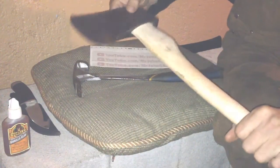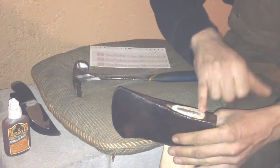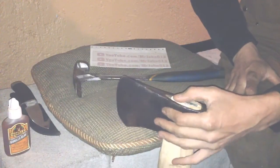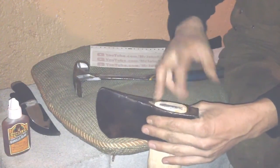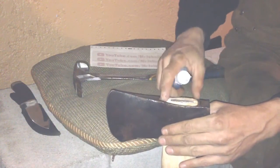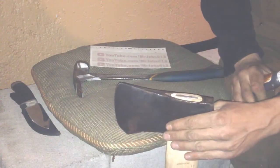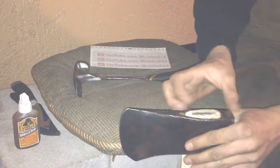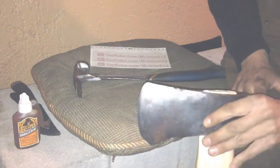Now it's a real good fit on the bottom, but on the top it's not quite as tight. You can do a couple of things - like I said you can put it in water. I've seen one guy use wood filler glue. I've got Gorilla Glue, and this is a really good fit especially down below - it's swelled out nice with the wedge. I'm just going to put a little bit of Gorilla Glue in the cracks on the front and back and activate it with water. Gorilla Glue needs to be activated with water anyway, and the water helps the wood swell up too.